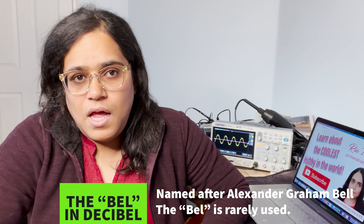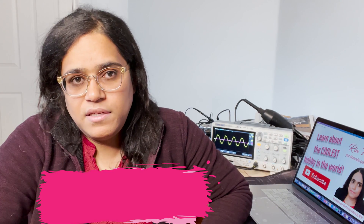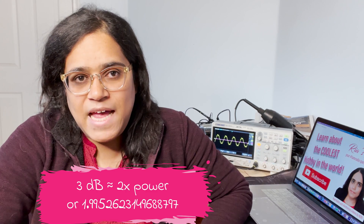Let's lay down some core concepts. First, let's talk about decibels. If you have a ham radio license you've probably heard about decibels, but decibels are more of a scale of comparison — you're comparing two signals against a reference. If you have one signal that's two times another signal, that's 3 dB. If you have one that's 10 times higher, it's 10 dB. You can roughly think of 3 dB as being twice and 10 dB as being ten times, and the cool thing is you can just add them — you don't have to multiply.